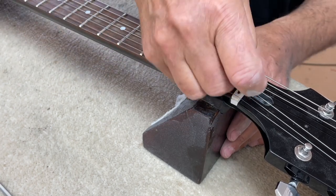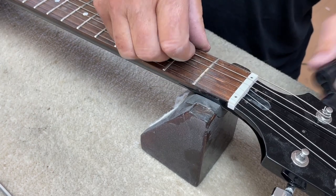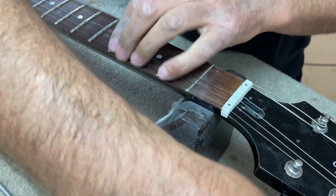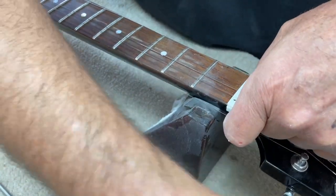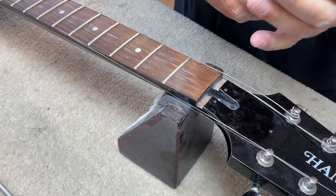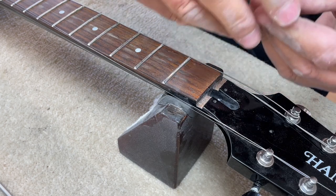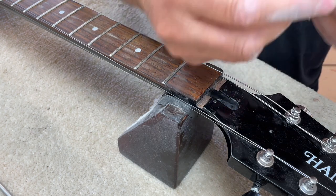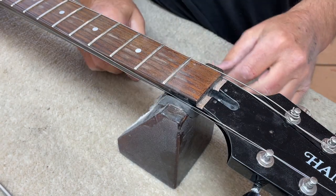I'm going to put a tiny piece of brass material into the nut which I like to do as a footing — to give the grub screws a little bit of extra something to land on. And what I've done with the grub screws is I've flattened them off so that they spread the load. I'll also put a little bit of brass in there.